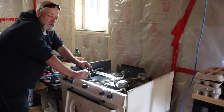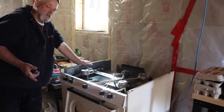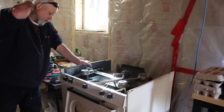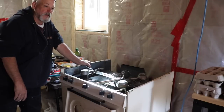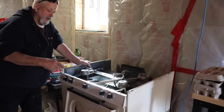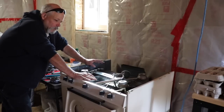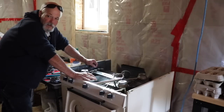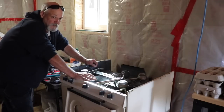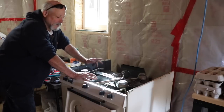It's 25,000 BTUs. And my thought is that I wanted to put one of these in anyway because I'll need a backup for the wood stove because I'm gone from the house about 12 to 14 hours a day during work days. So there's no way that with the firewood that we have in Alaska, that stove is going to keep the place warm. And I don't have somebody to come by and feed the fire for me. So my thought was that the wood stove will be the predominant form of heat, and then the vented propane wall heater will pick up whenever the stove dies down and can't keep everything warm. So it'll keep the temperature inside at about 60 degrees Fahrenheit, and then I don't have to worry about that. But anyway,